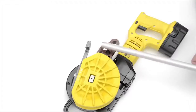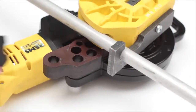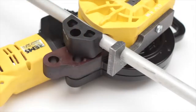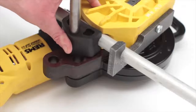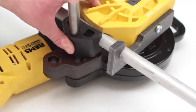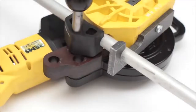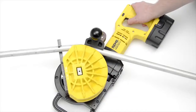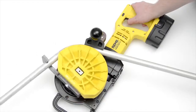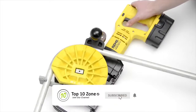The 7/8 of an inch tube is fed through the driver prior to being bent, then the back former is offered up, then located by its insert bolt. Depress the inching switch and tube bending will commence. Keep the inching switch depressed until the required angle of bend is achieved, in this case a 90 degree bend.